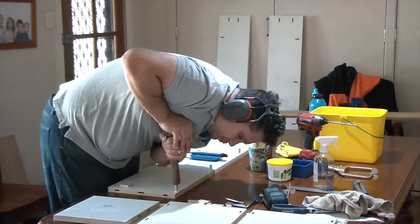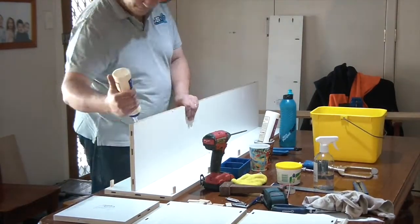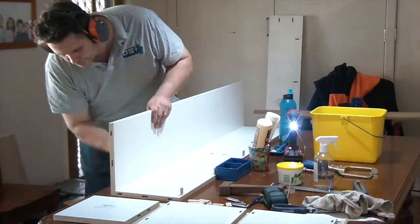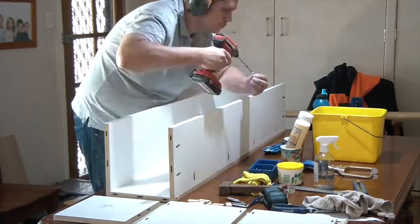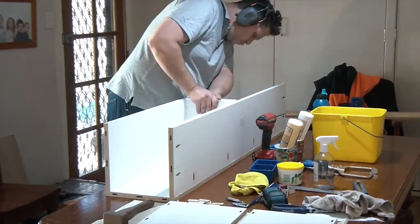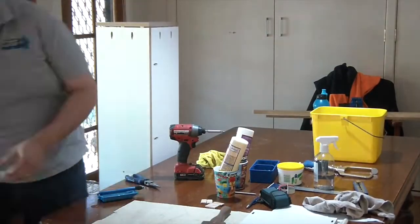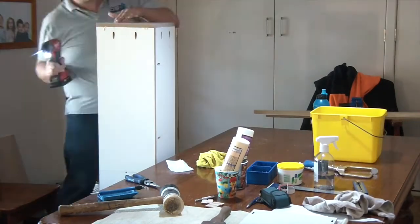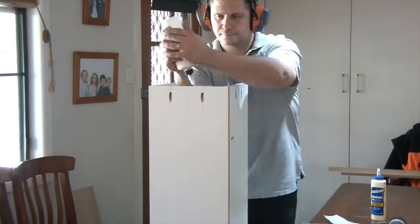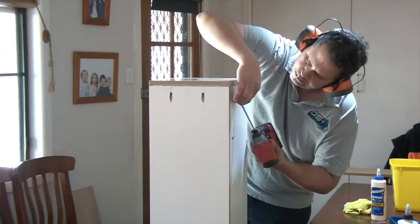What you're seeing me do here is use regular Titebond II for the dominos into the raw MDF, and then where I'm joining panels which have a combination of raw MDF and white melamine coated MDF, I'm using Titebond Melamine glue — that gives you a super strong joint to the melamine. I'm using pocket screws instead of clamps. I did do one with clamps and no pocket screws and I'd probably rather get a vasectomy again than repeat that process. The pocket screws pull everything together, I don't have to stress and wait for clamps, and none of these pocket screws will be seen — they're all completely concealed by the rest of the joinery or by the wall.